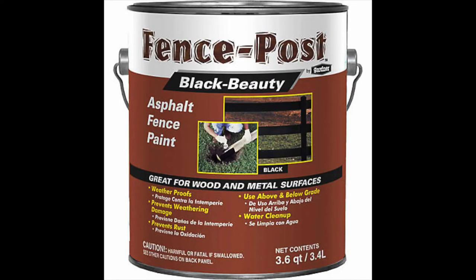For today's project, we are finishing up some top rail on our pasture fence that we put in a while back. We have a couple other videos on our pasture fence. This time I'm switching it up a little bit and I'm going to use some solid stain instead of using the Black Beauty fence paint. Originally we painted the whole fence with Black Beauty fence paint, which is an asphalt-based paint, but it didn't stick and adhere very well, so it's lasted a couple years. I'm going to try this stain and see how long it lasts.